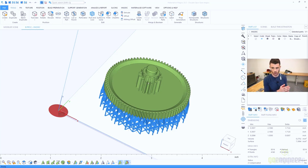I have not opened this job yet. Part of what this machine does — we generate the slices, process and generate support inside Magics, then create a build file and upload it through a browser. We use Chrome, log into the Exact Metal machine through Chrome, and send the job over the network. There is also a USB option if we can't connect to the network, but the network upload is the way to do it — it's a little bit faster.